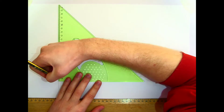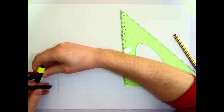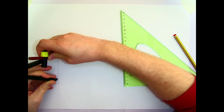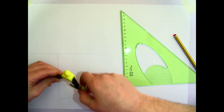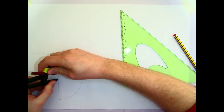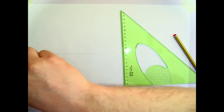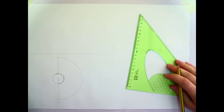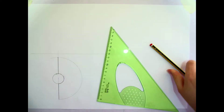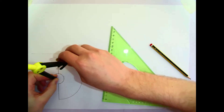The diameter is 120, so the radius is 60. I'm also drawing the center circle at the same time — this is the radius for the outer part, which is based on a cone. And then the cylindrical part at the top has a radius of 14, diameter 28. I'm going to darken in this part now on the plan, so that I can see what's there. There's a solid line running vertically and then the outline for the cone.